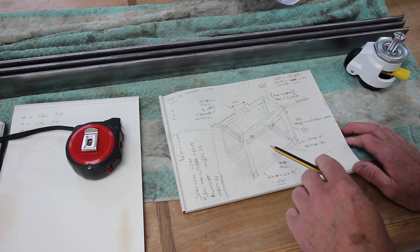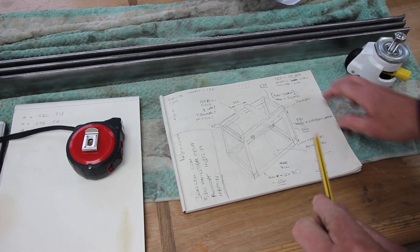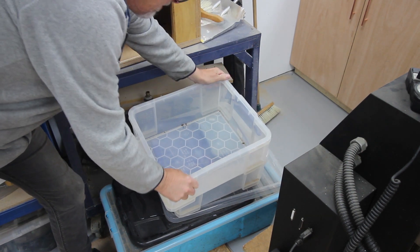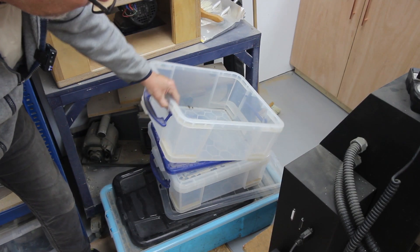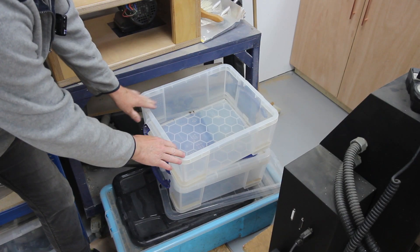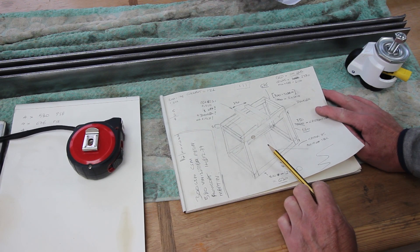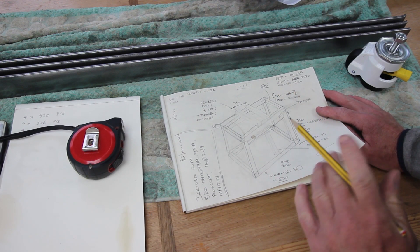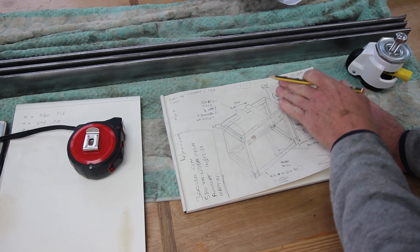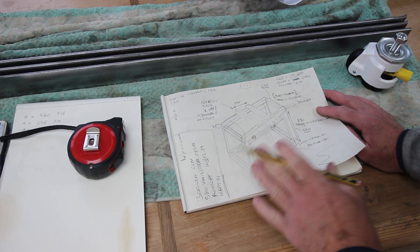In this version I'm going to reuse a plastic box — I'll drop in a rough shot of what they look like — from a company called the Really Useful Box Company here in the UK. They are quite rigid and they do a high strength version as well. This example is only 18 liters, which isn't big enough. The one I'm going to get is about twice this size but twice the depth, so I'm going for 35 liters — I've more than doubled the amount of coolant. It's going to sit in here and I'm going to have some angled plates under the mill so that it drains back into the tank through some filters.